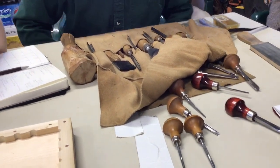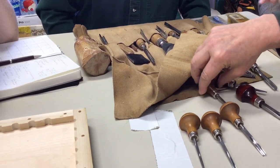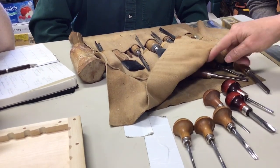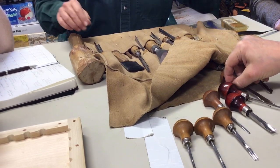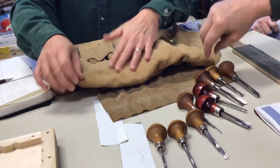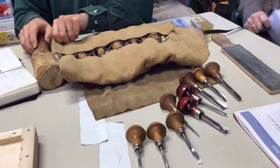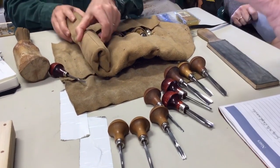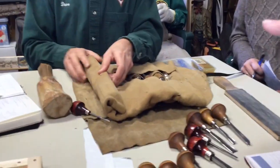As a woodworker, if I can throw one thing in, if you're using a mallet, always do it over a leg, never in the middle of a table. Because in the middle of a table, you get bounce. Over a leg, you transfer that pounding energy directly to the floor, and you will use half the energy using a mallet as you would in the middle of a table. Because the minute that you start getting bouncing, you lose.